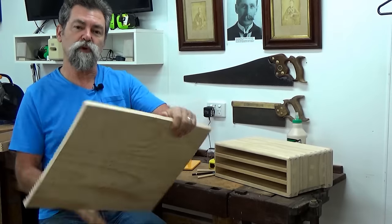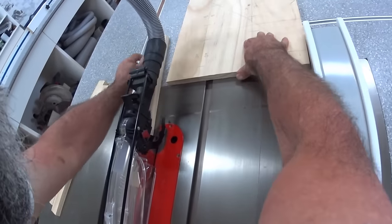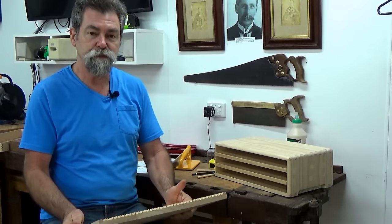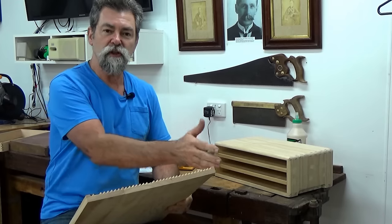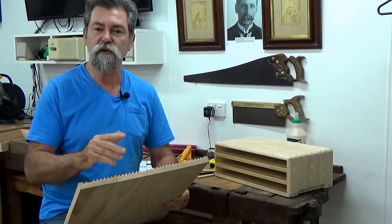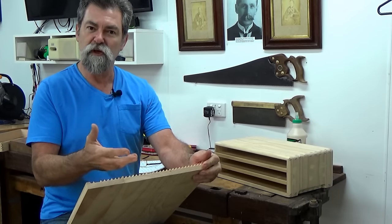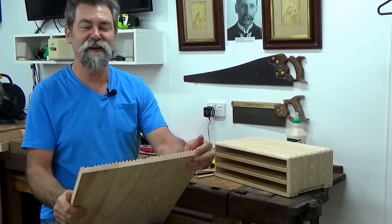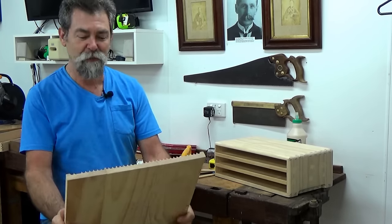Put it through the table saw to 380 millimeters wide overall, and that will give you 36 slots that are 10 millimeters wide — those will be our spacings. We'll have two 10-millimeter spaces outside either side that we can trim to fit each individual cradle into its drawer. We're going to match them — it's easy to do, just use your thinking cap a little bit.